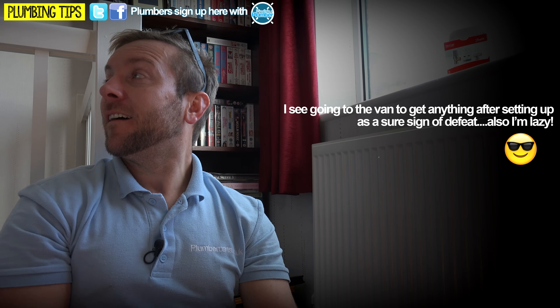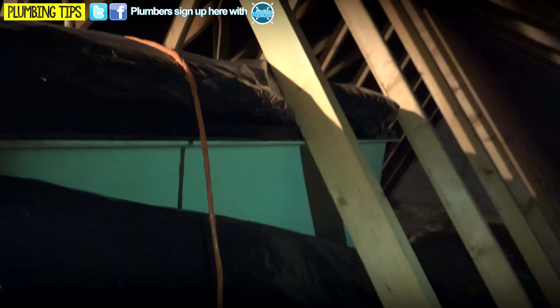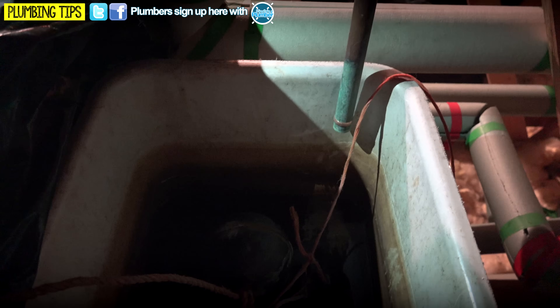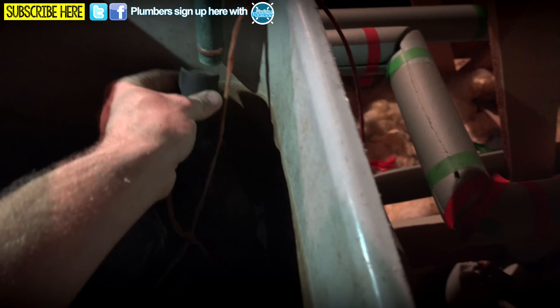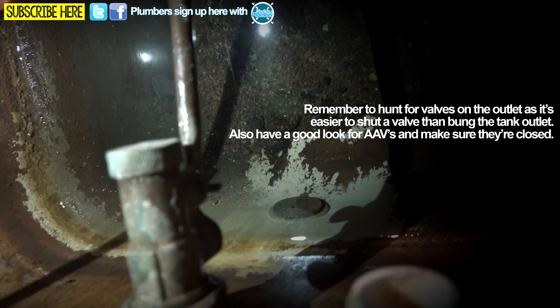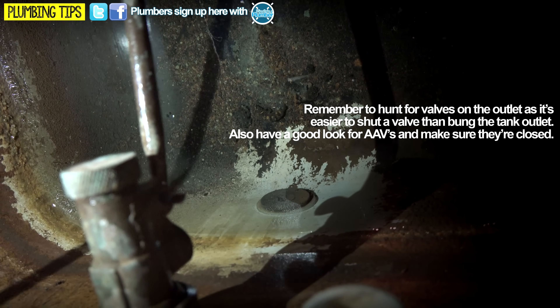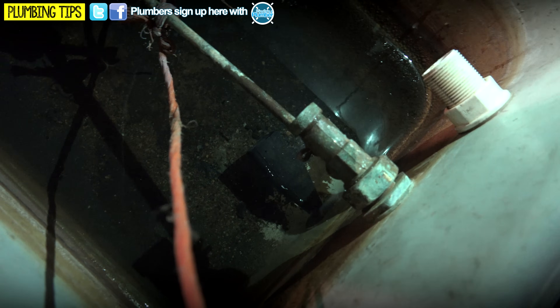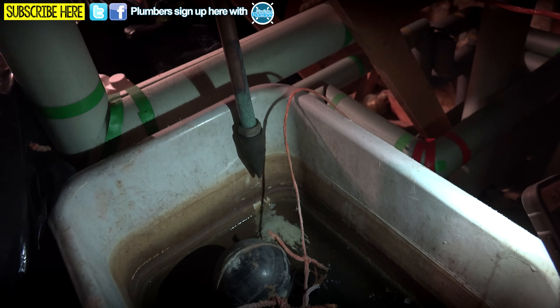So now I'm going to pop up into the loft and bung the system to get it ready to pull a vacuum. Right, so here we're up in the loft. This is the sort of thing we need to look for — there's our tank, there's our expansion pipe or vent pipe. It looks like someone's left a nut on here in the past; I'm just going to swing that out of the way. You qualified plumbers are going to have something like this to pop over the end — just pop that over the end like that. Now we've bunged up one part of the system. We also need to find this outlet just down here and get the pointed end stuffed in there as hard as you can. There's our bung stuck in there and our other bung stuck there. So now we've put our thumb over the top of the heating system effectively.